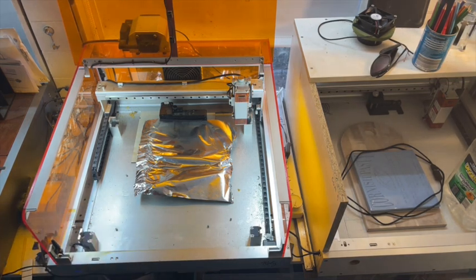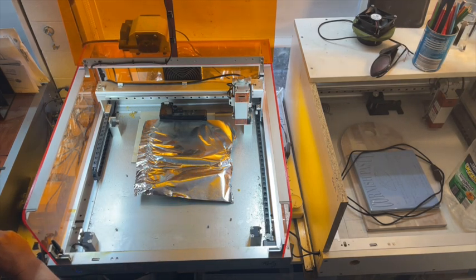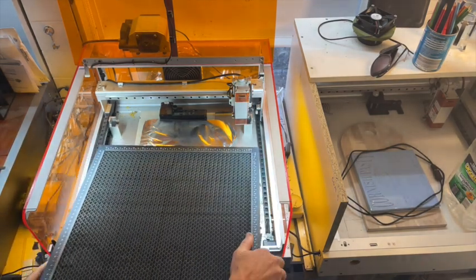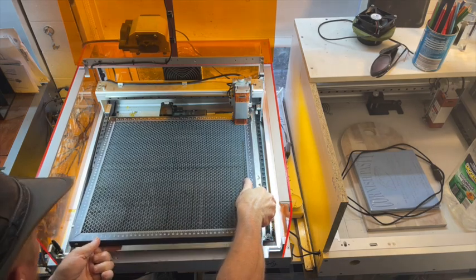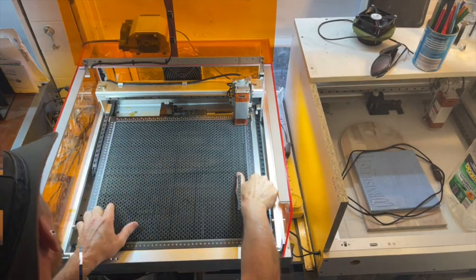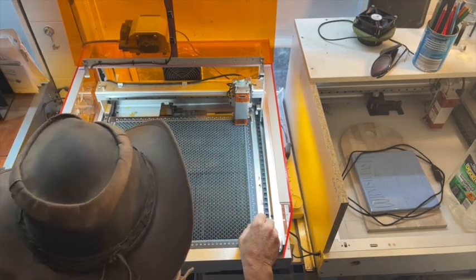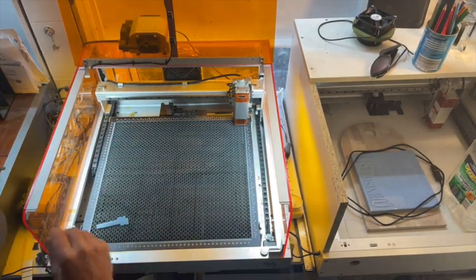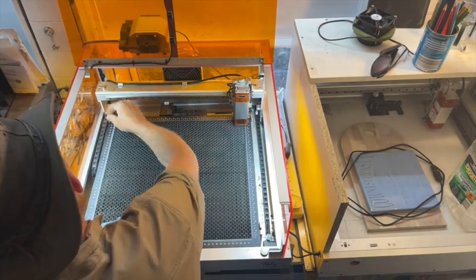All I'm going to do is use some window packers, which look something like these things here, and see if we can get it to where we want it. Now I have done this already, so therefore I should be able to just use the ones I always was. Okay, so I have a 1.5 on each side. The top needed a bit more, so that's 2mm going in there.